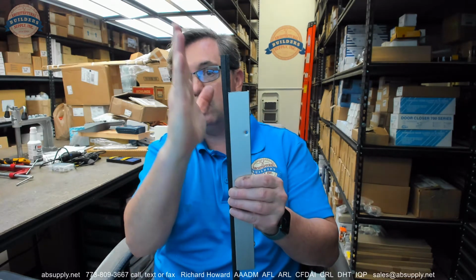So the other reason you would use this is when you have a door and a frame that the door closes, but the jamb is not plumb or the door is warped, and that condition is permanent. And rather than taking your weather stripping and installing it on an angle, which you kind of can't do because you may not have a linear progression on whatever's happening on the door and frame, you might need to be able to literally tailor this as it moves up the opening.